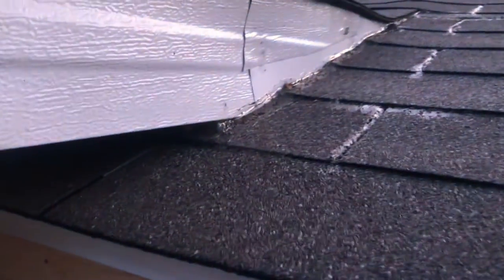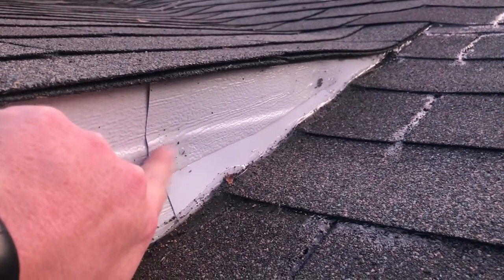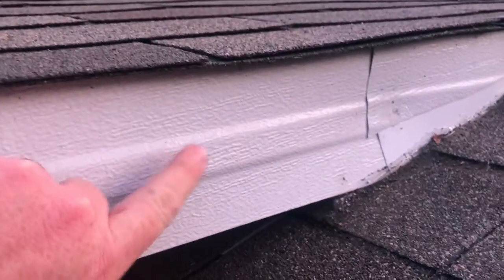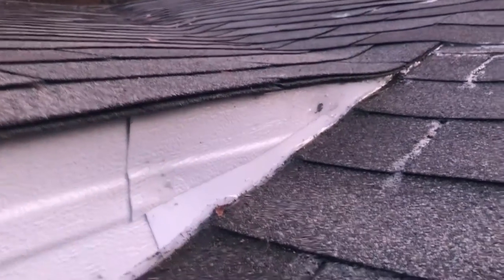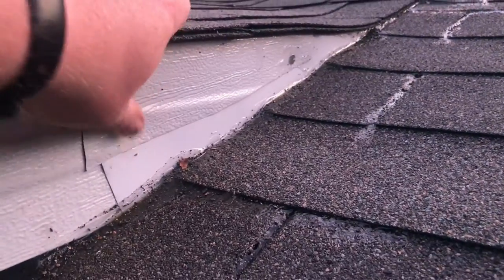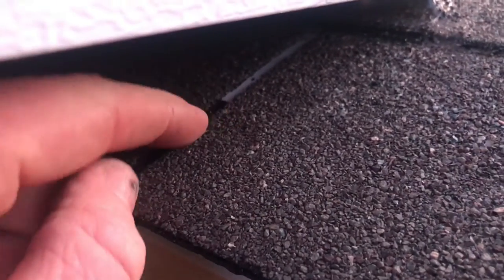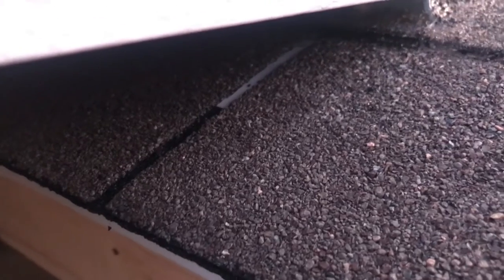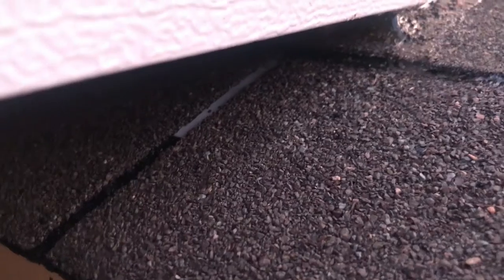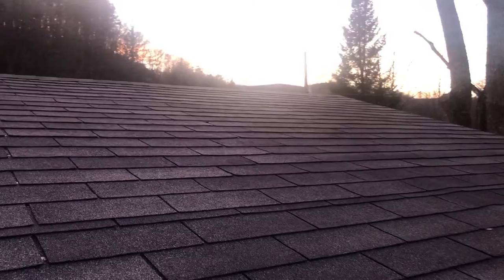Here I'll show you — see that flashing I put in? There's the flashing I made. This is a piece of the original fascia trim and I just trimmed it to go over that. You can see I put Lexel over the nail heads, and you can see right down here is my starter strip. You can see how that piece of trim coil comes out on top of that.